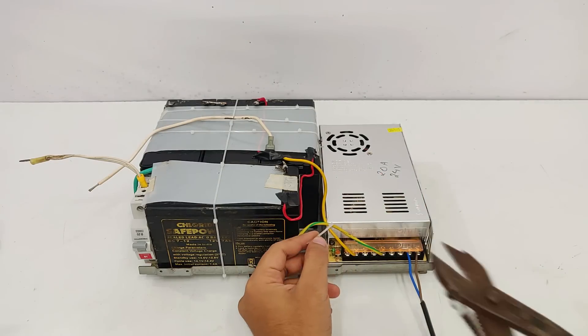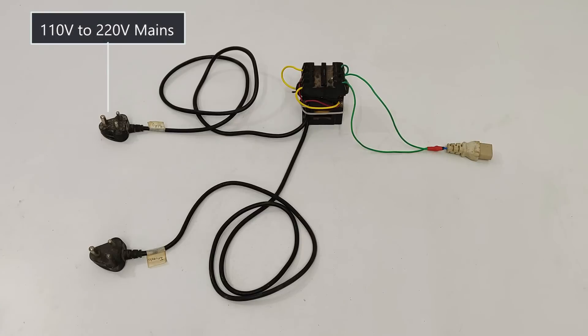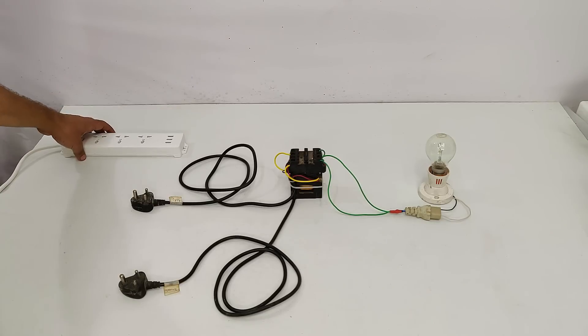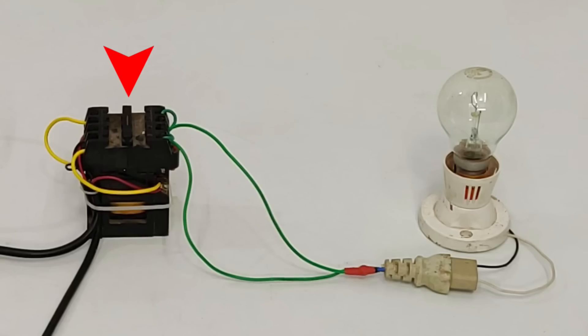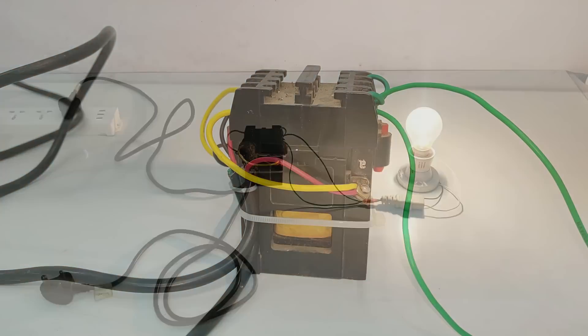The device is fully complete and now it is time to test it, which involves this very important device. Here you see two plugs and one output. In the middle is the contactor. This plug is for 110 or 220 volts home socket supply. The next one is your 220 or 110 volts inverter plug, and the load will be connected to the final output. Let's first connect the home socket mains plug. When I turn on the mains board, the contacts are made on the contactor and the bulb lights up. And when I turn off the board, the contactor is released and the bulb turns off.